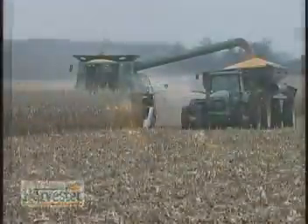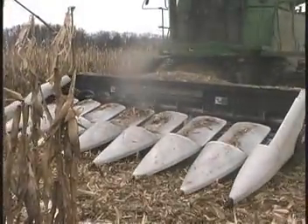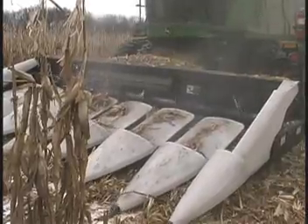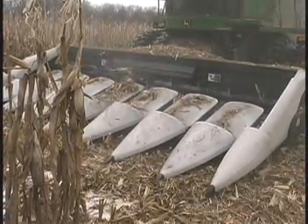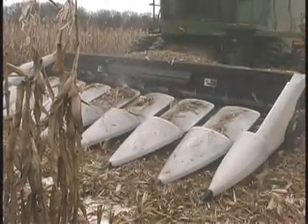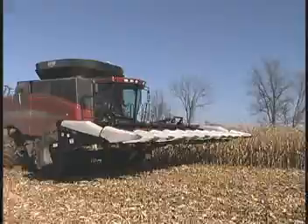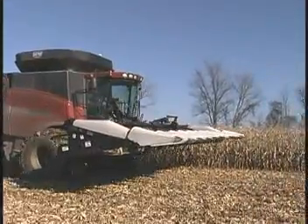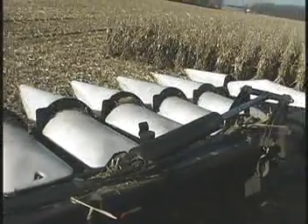The snout's white color ensures easy visibility through thick crops or when you're running at night. To handle high capacities and yields, the large-diameter auger has deep extended-pitch flighting, large enough for the high volume of material being fed into the combine feeder housing, and the auger discharge section can be fitted with flighting or fingers as well. All metal parts in the Harvestec 4000 series are electrostatically primed in a protective dip coat prior to finishing, ensuring a long and corrosion-free life.